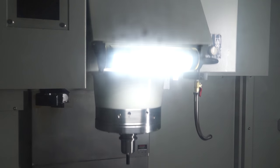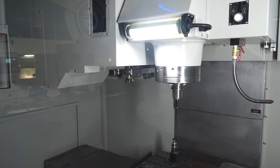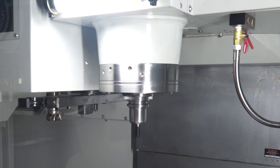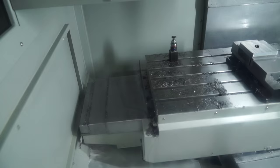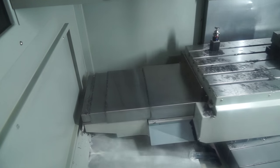So with this being the E here, just step through some of the things like the tool changes, the spindle speed, through spindle coolant, that type of thing. So the basic specs: it's a 30-tool ATC with a quick arm tool change, it's a 12,000 RPM spindle with face and taper contact, it's got 20-bar through spindle coolant, and as a package it's a full package including swarf management. It's a very compact machine, so the swarf management sits behind the machine — we have two augers and wash down, and everything is taken through the back of the machine.